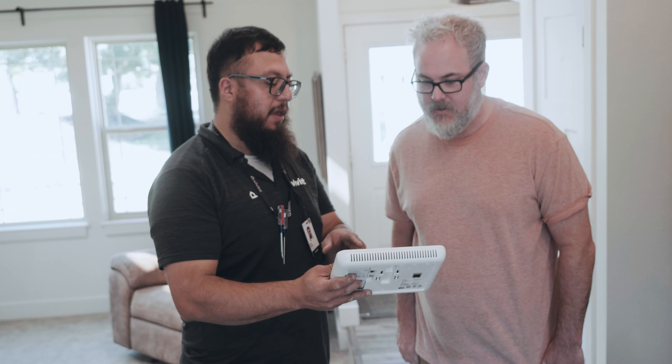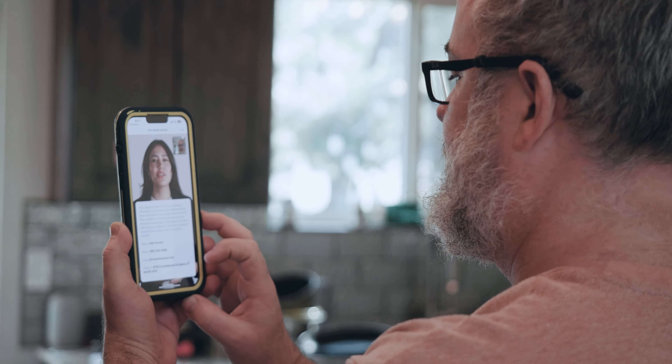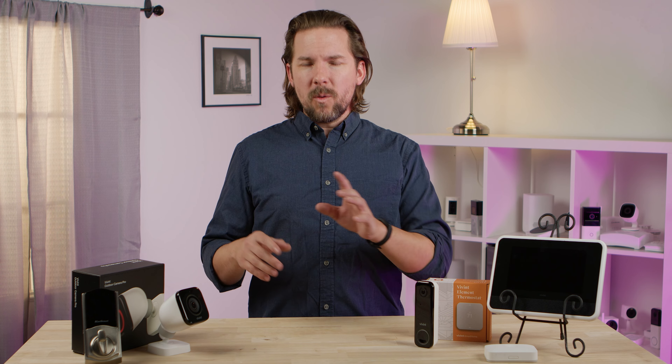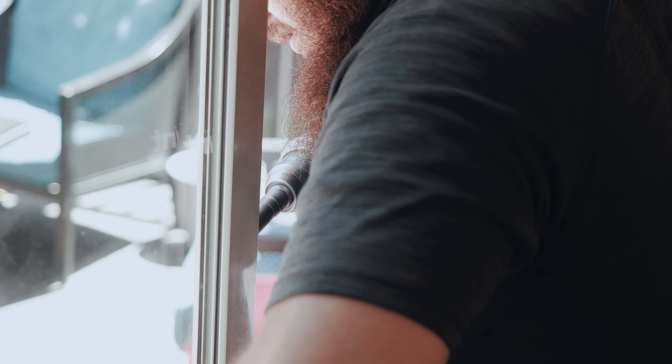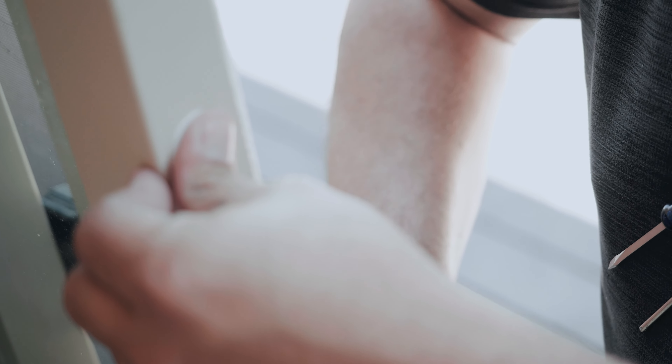As far as the pro installation, it was awesome, quite frankly. I didn't get to do it — I was working on the DIY systems. But we have another tester, John. The installer worked with him and walked him through every step of the process, explained every part, every device, and trained John on how to set up the system, how it works, how to adjust the settings, and how to get help if he needed it. With DIY systems, most door sensors are peel and stick — you put one side on the door and the other side on the door jam, and when they move, you get that magnetic break that sets off the alarm. With Vivint's, though, they integrate that more seamlessly into your home, which requires some drilling and a little more work. But it looks a lot nicer — it sits flush in that door jam. Pretty nice looking.